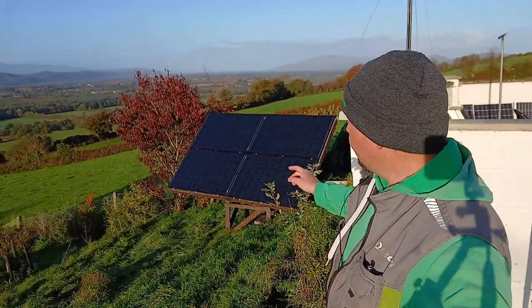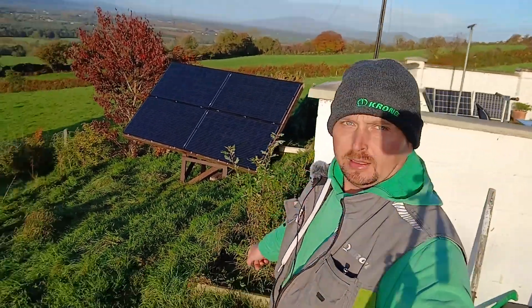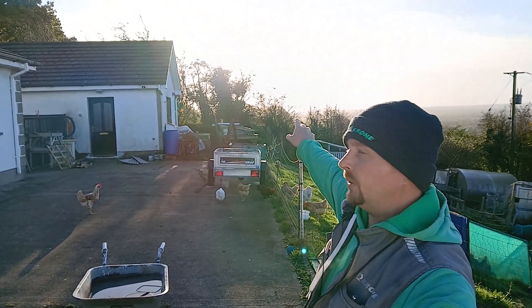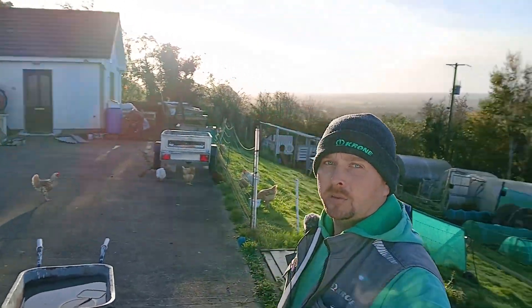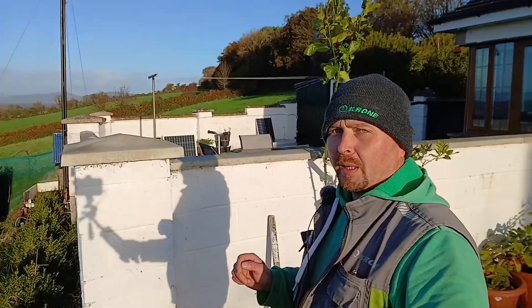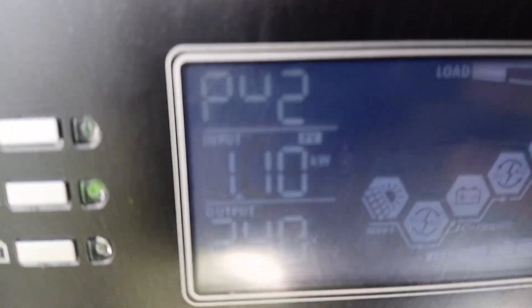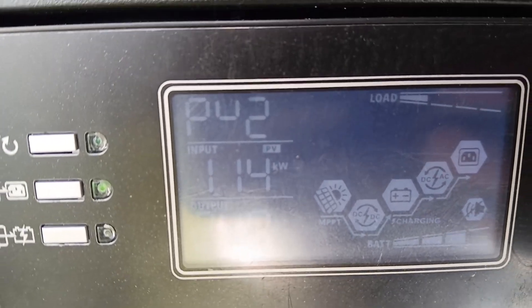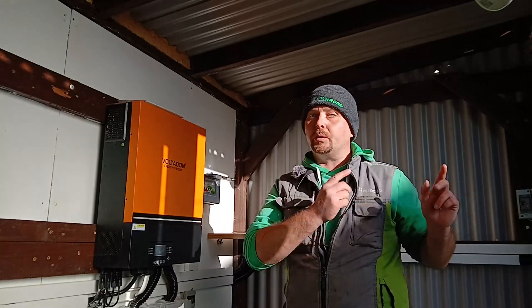We have ideal conditions to see what power we're getting out of this rotating array. It's just after eight in the morning and I've turned the array just by hand. Because it's late October you're going to get lens flare, but the sun is just peeking out over the trees over there. It's extremely low in the sky, and that's exactly what this solar array is meant to do — catch that early morning sun. There's bad weather due for tomorrow so the video has to go out on Friday. This is perfect testing conditions. Let's just see what it's bringing in — there you go, 1.06, 1.1 kilowatts. We'll come back later and check on it again, and get on with the rest of the job.